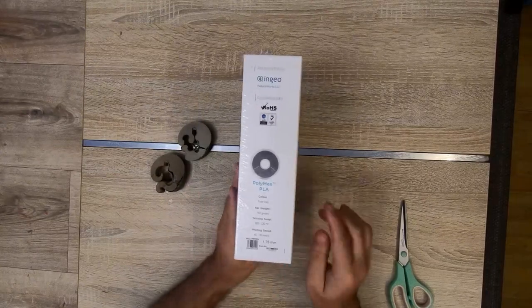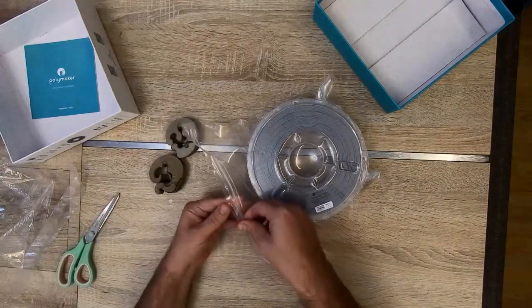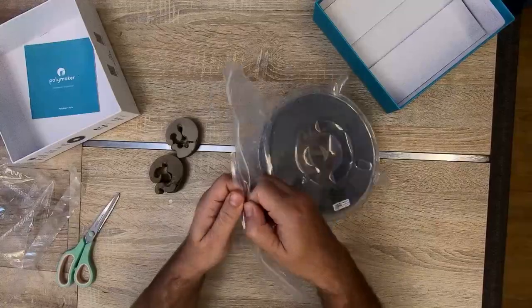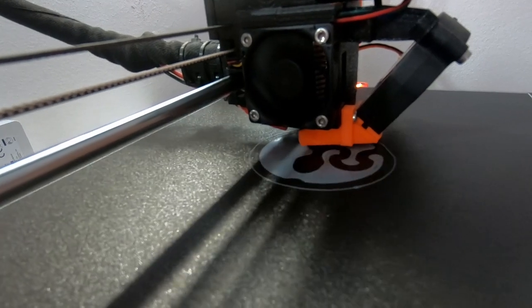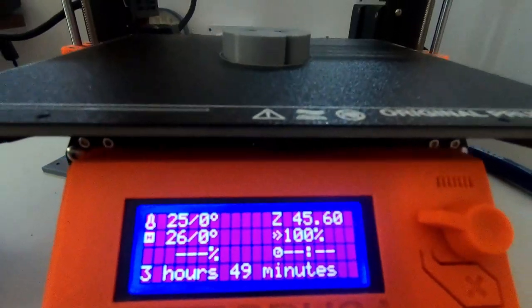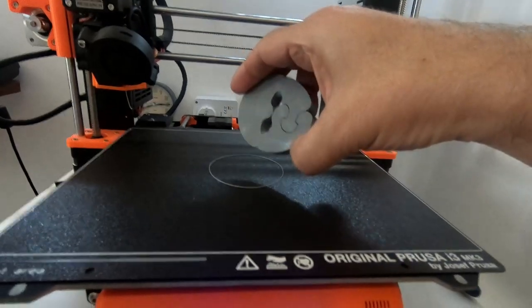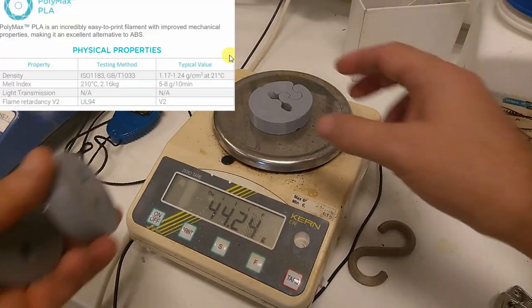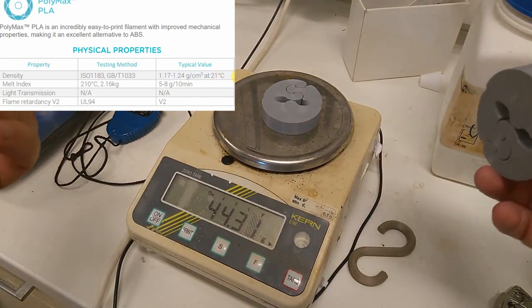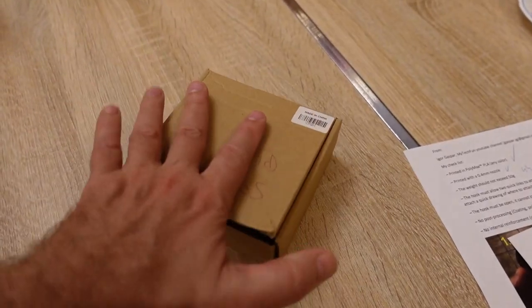In the meantime, my PolyMax PLA arrived. I like these plastic bags because when I finish the printing I can add some silica gel and use them as spool storage. I printed everything at 220°C to get better layer adhesion — if the load is not uniform, the layers help each other a little better. Here you can see a gap, and a quick test suggests the density was on the lower edge. Anyway, I posted them as they are and didn't reprint them.